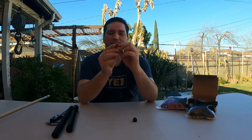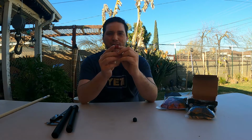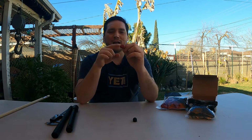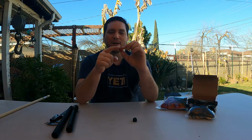And what that's going to allow me to do is see how that stabilizes the projectile in flight, okay? Because you don't want something nose heavy where it tumbles. You don't want something rear heavy where it yaws before it exits the barrel, you know? So maybe centering up that mass is the way to go, but also keeping in mind that it is a little bit nose heavy, or it should be, because this is solid up front and this is hollow.